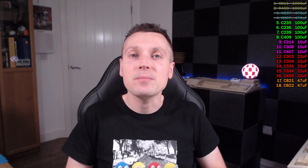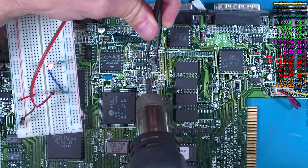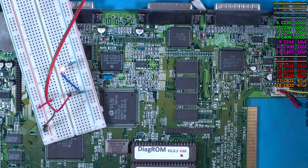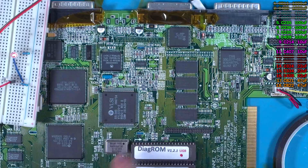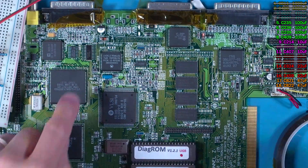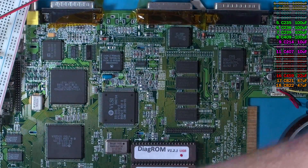Did any of you guess wrong? Well, on with the surface mount capacitors. The first will be C303 and C304 — sadly I don't have the footage for C304, but neither of these are across the power supply anyway, so it's no real surprise they weren't at fault. Moving on to capacitor C306 — not that one. On to capacitor C334 — nope. And capacitor C324? No, not this one either. As both of these were part of the audio circuitry, I didn't expect them to be.